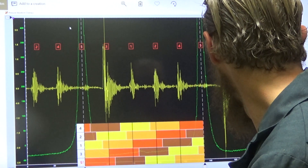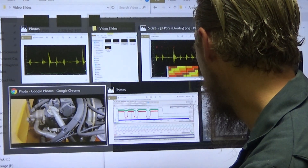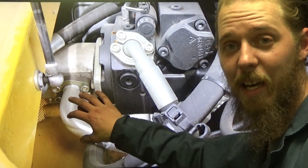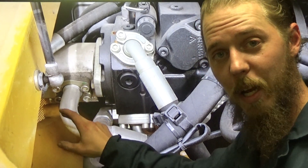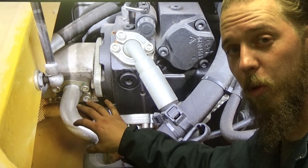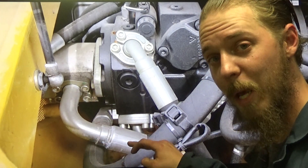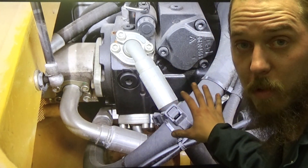The base applications are the same. What we're concerned about is being able to come in and not have to take this apart. If we could clamp a regular pickup on any one of these metal fittings — we do have to watch at angles, since fluid starts to flow turbulently through bends — so we want to be on a straight section, maybe at the neutral or down here. I'm not sure how much the actual rubber hose carcass will transmit vibrations, but I'd assume it would be pretty decent.